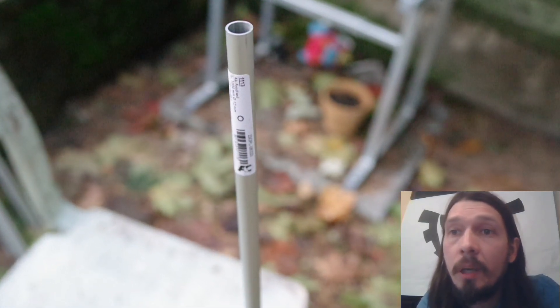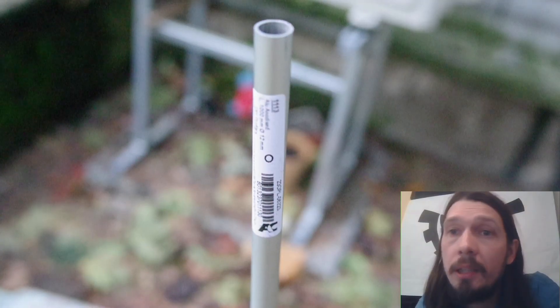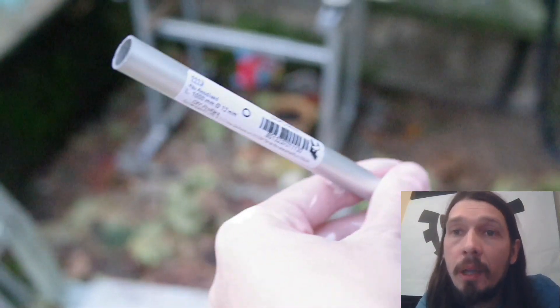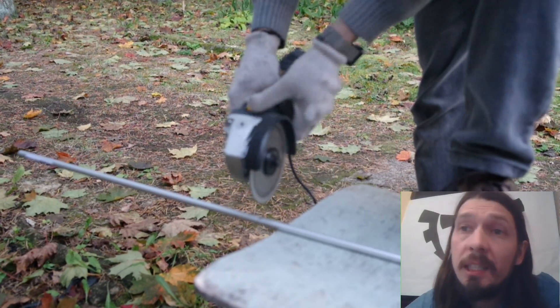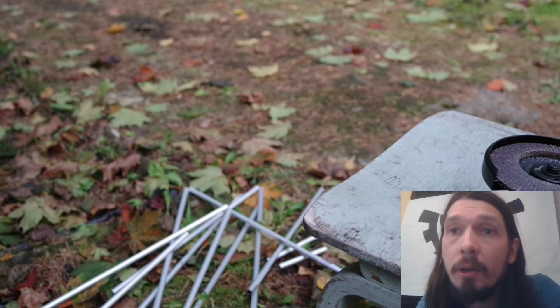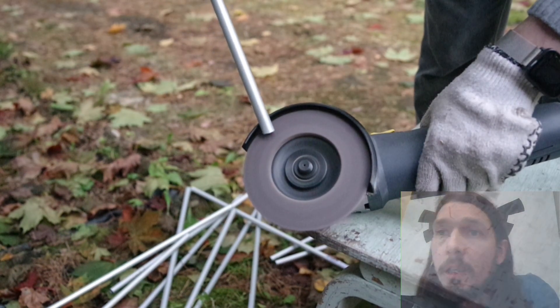The core is the heat exchanger. Aluminium tubes work really well for this and they're easy to find in most hardware or building supply stores. I used tubes 12 millimeters in diameter with 1 millimeter wall thickness. You need a lot of tubes and it's important to find a shop where they are cheap — prices can vary by almost three times. I bought 1-meter tubes and cut them in half.